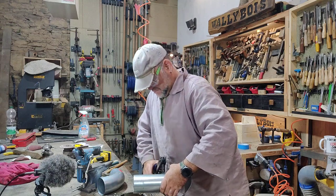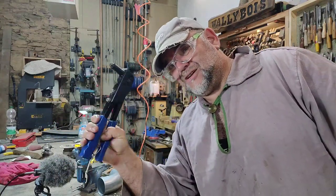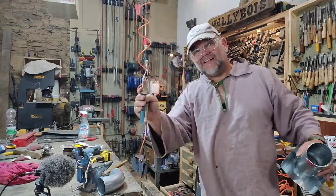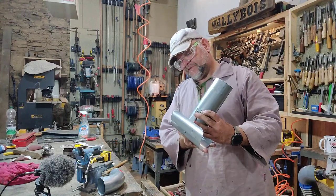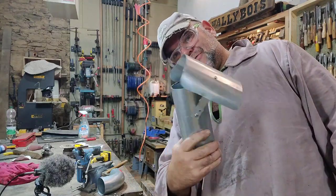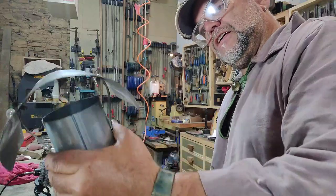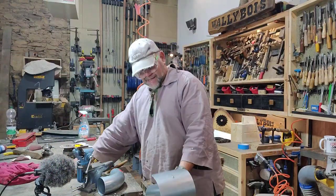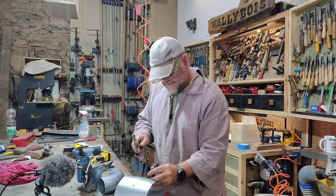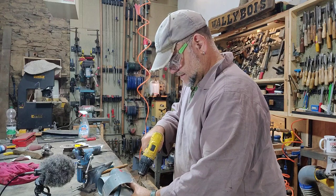With just one rivet it's going to be floppy. When you're doing this, don't hold it so that when it finally goes it hurts your fingers — make sure your fingers are always on the outside of anything you use as grips. Never put your fingers inside if you can help it. I might have to use the centre punch again to make it easier. I'm going to drill that one.